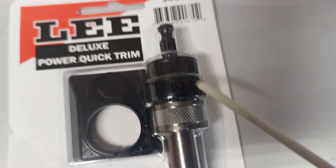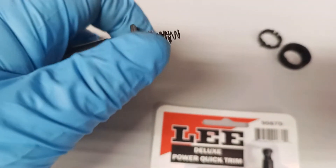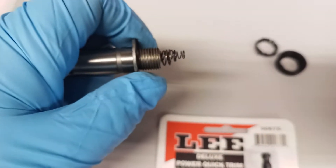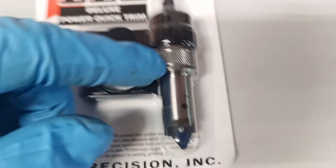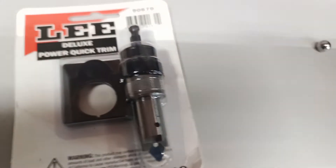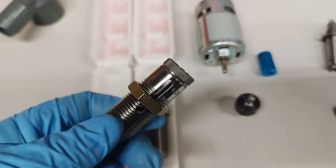These are the parts from the micro adjust that were removed — they were once located right here. I replaced them with this machined washer, which threads down over the threads and gives a nice tight fit when the system is assembled. It provides a bottoming-out spot on this collar. If you're using large rifle, the collar is removed and it will bottom out on the die itself.